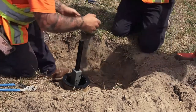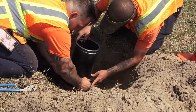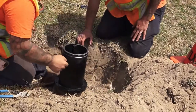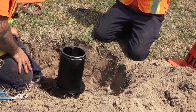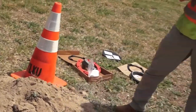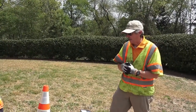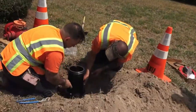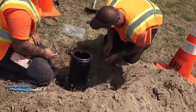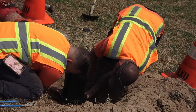We're going to hand the gentlemen the extension barrel. The length of extensions in our industry can be as short as six inches and as long as 48 inches, as we discussed. One extension per fire hydrant keeps rigidity in the rods so it doesn't flex or hammer. Right now they're dropping in the new lower extension barrel bolts — these are all stainless steel — and getting them hand tight to start.